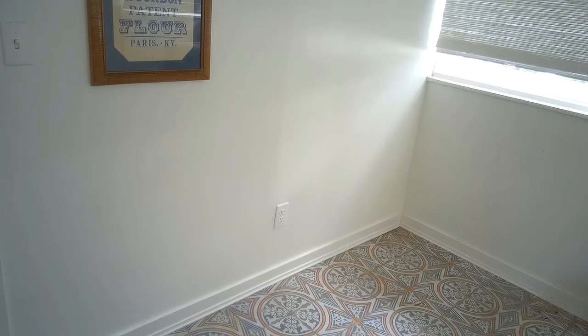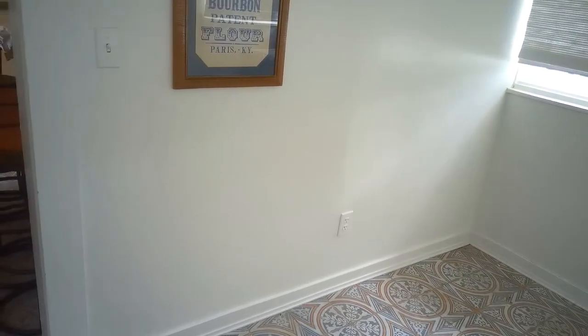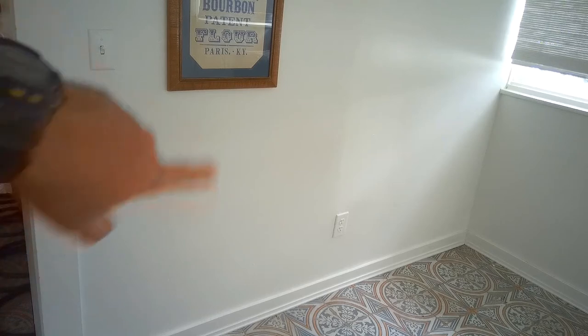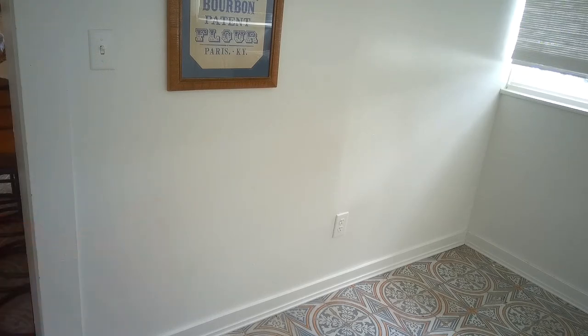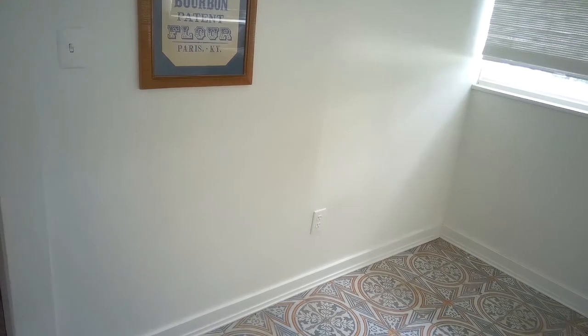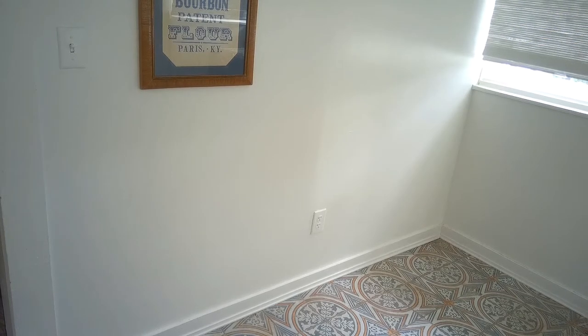All right, here's the spot where the 6 foot countertop is gonna go in, is the 12 inch base cabinet towards the end where there's gonna be some floating shelves coming off that. Towards the right above the outlet there, there's a pretty big bulge in the wall, which I knew about, that we're gonna have to work on seeing how we can get it in there so the countertop's straight, whether I have to notch into the drywall or work on the countertop a little bit, probably a combination of both.